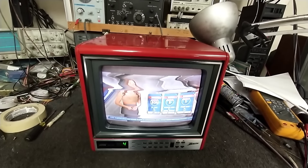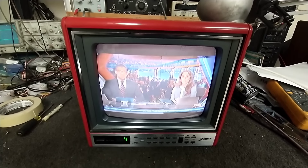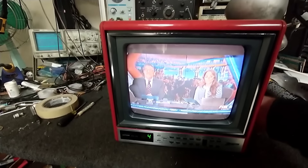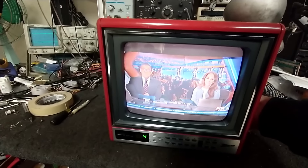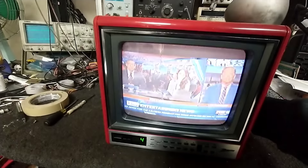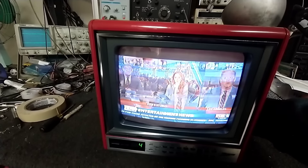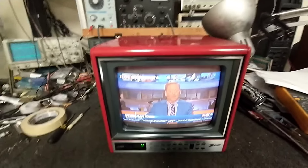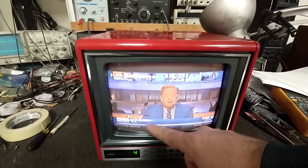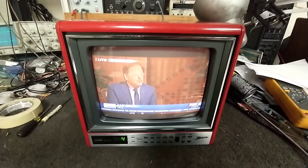There's also a lack of contrast overall, and it looks kind of dim overall. Cranking stuff up — that's maximum brightness there, so that's not good either. Maximum contrast doesn't really do much. We also see a lot of smearing to the right here. So definitely power supply issues are going on. Let's crack it open.